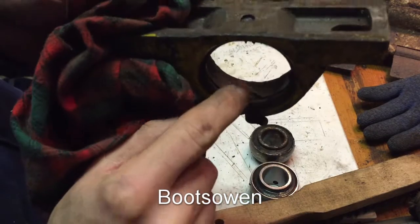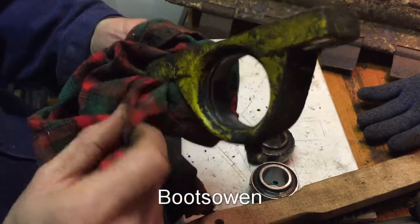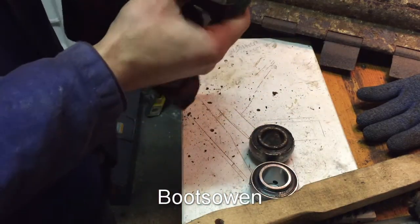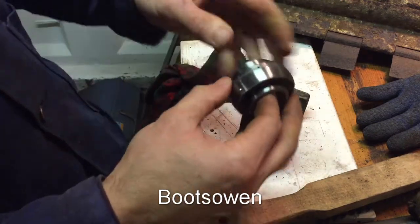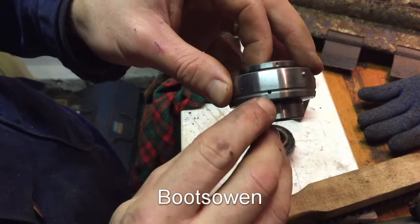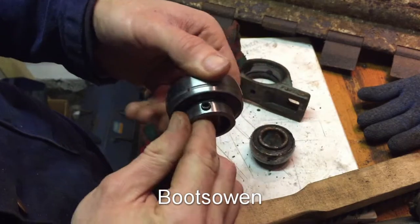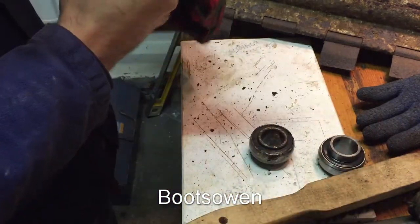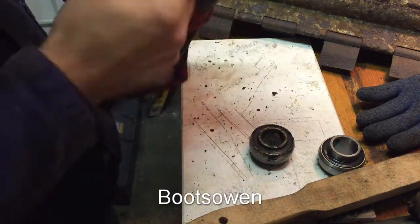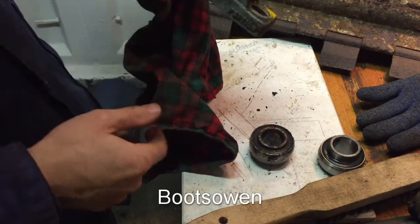You can see inside there, grease nipples on the outside, comes through this little hole and runs around in this ring here. Grease that is, and then that should marry up with this ring here and then go into the bearing through this little hole here. That's the concept. So the grease that's in the groove is quite clean, and the inside there doesn't appear too bad.